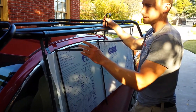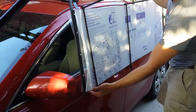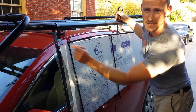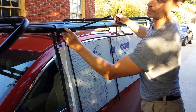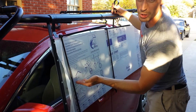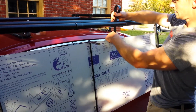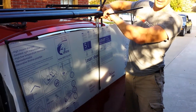Because of this frame piece and the angle iron at the bottom, this will be fairly stiff up here, so we'll only use a 15-inch length. This will be bolted in right up here — 15 inches down, right about here, about two-thirds down. The other one will be 17 inches and will sit right in front of the middle hinge.